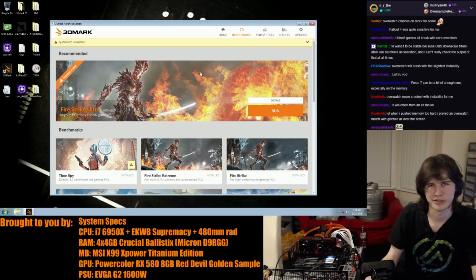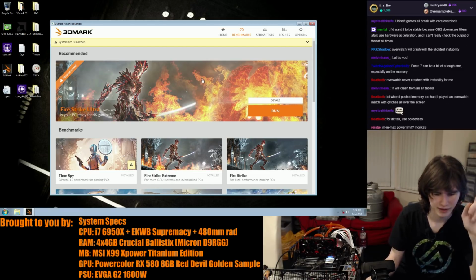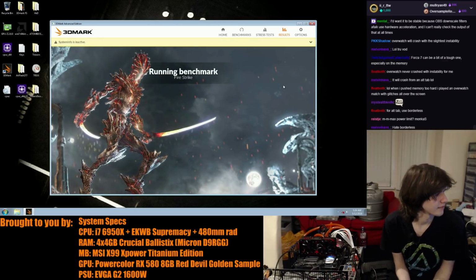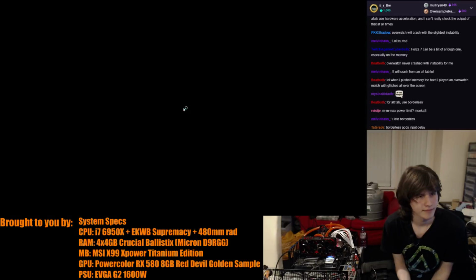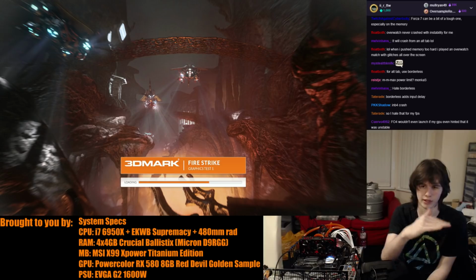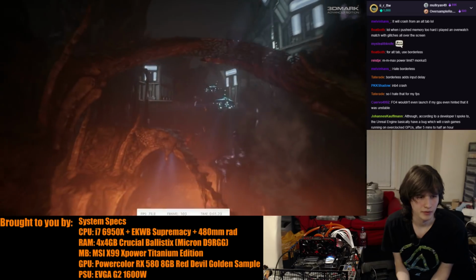Yeah, I don't play Overwatch, so I don't know how stability sensitive it is. But I have heard that Overwatch, and there's some other games out there which are just way more crash happy than your usual benchmarks. I wonder if I could drop the memory timings even lower, because I don't think it'll change the max memory clock that much. If you look at what the timings actually look like, they don't look like they're that different across the frequency range. So it might be possible to go lower.